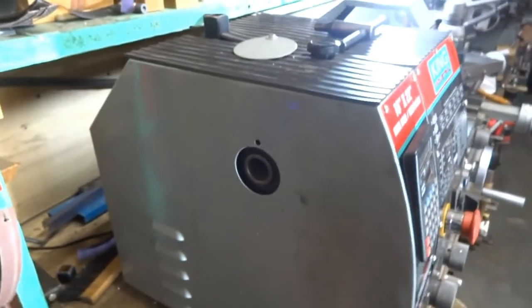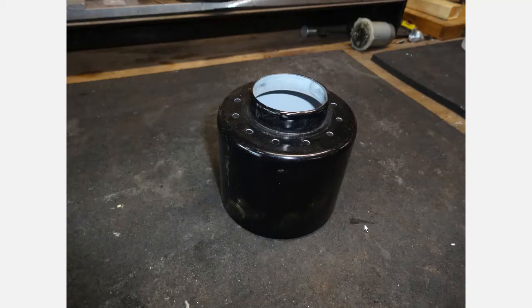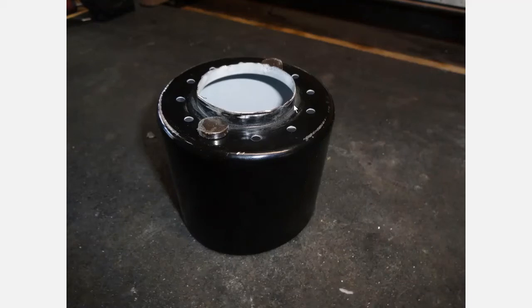I wanted to come up with a solution to fix the situation. This is the shade of an old light bar that used to be over one of the light bulbs. I thought I could use this to catch the chips that came out of the back of my spindle bore on the lathe. This part was going in a little too deep, so I needed to hacksaw that off — not a very pretty job, but it's about the right size now.